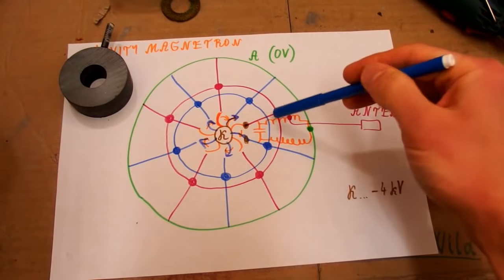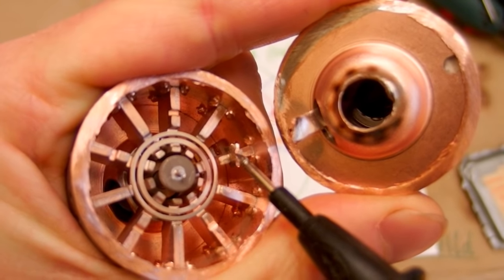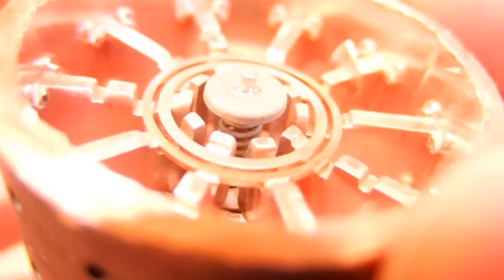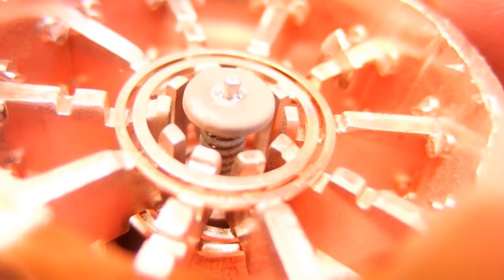The main factor is the resonance frequency of the cavity. The anode works as a center tap on this inductor and the antenna is also a tap on the inductor. The electrons alternate between those two ends of it, alternately pulling the voltage on those two ends down.